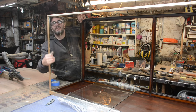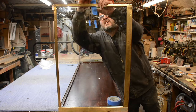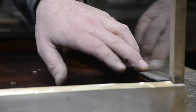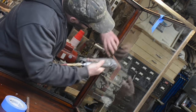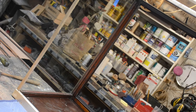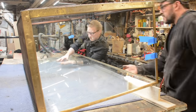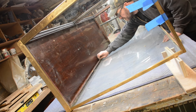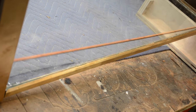You can't tell the difference. Here, this is me trying the glass in for the very first time and everything fit — thankfully I didn't have to go back and adjust everything. Now I'm putting back the same few strips that I popped out in the beginning of the video. Everything went right back into its original place. I took the original nails out and I'm just using these small pin nails — they're also safer; I feel like they wouldn't break the glass as easily as if I was to use an 18-gauge. This is the original front piece of plate glass, and for some reason it was a little short, so I put spacers to raise it up, and then that piece just barely captured it.